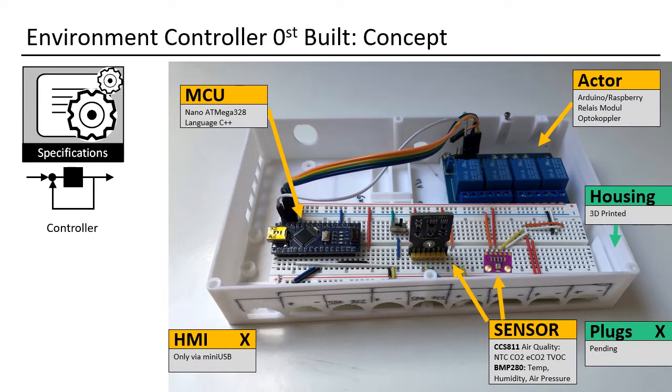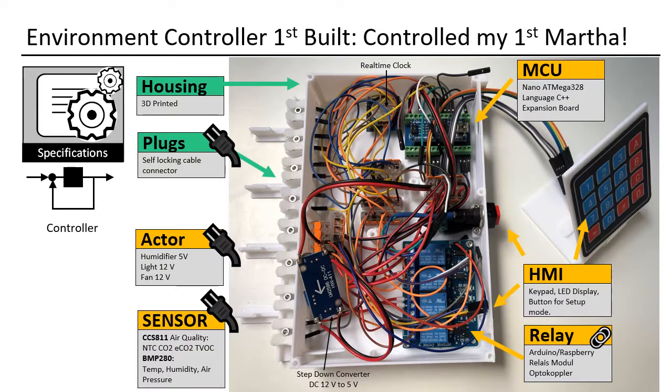This was my concept build. I started with an Arduino system — one had to program it with C++. I also used a CO2 sensor back then, but I learned that it is not necessary. Just set up your airflow as the mushroom needs it. The first controller I used had strain reliefs for external actors, fast connectors, a display, a keypad for input and status control, a real-time clock to know the time, and a CO2 sensor. If you put a cap on the box, it is also clean.